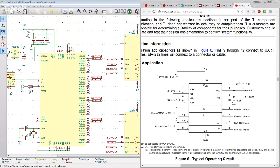And this is why, even today, your motherboards' 20 pin power connectors have both a plus 12 and a minus 12 volt line coming from your power supply, because the expectation was that you would need that minus 12 volt rail for your RS232 transceivers. I've worked on some computer systems recently where we had to build this minus 12 volt voltage regulator to be standards compliant, but we knew that in the entire system, the only thing this minus 12 volt rail powered was the minus 12 volt rail good LED. But to be standards compliant, we had to have it, which was painful.